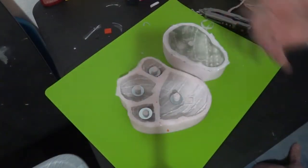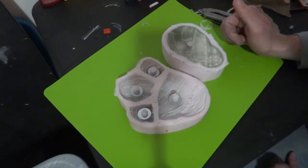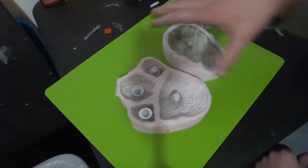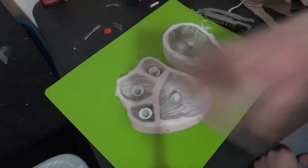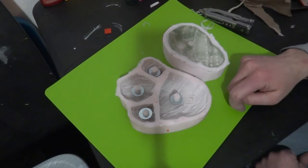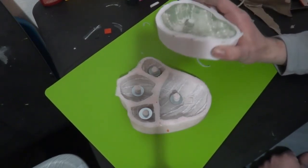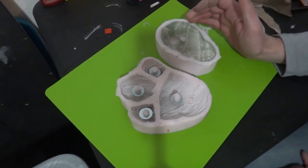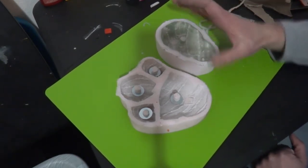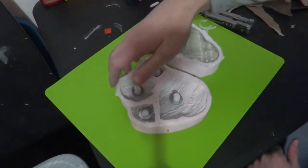If you've got the silicone on hand to cast them, you don't want to get ridiculous. You don't want molds a whole foot and a half across. But if you've got a series of small holds, put them all down together, cast them together. That way, they're all in one piece and you're saving that cost on silicone. Otherwise, you're just making a lot of sidewall for one mold. I generally like to do at least two or three together. But for the purposes of this training, I didn't want to do that many pieces.